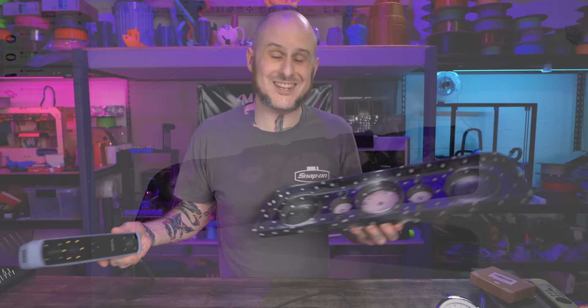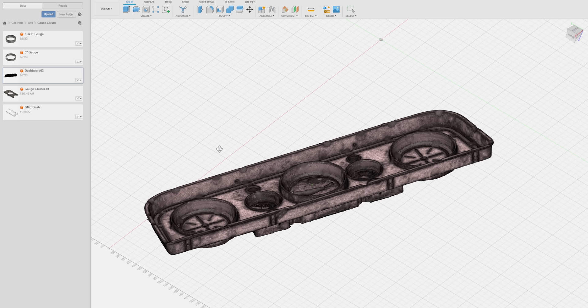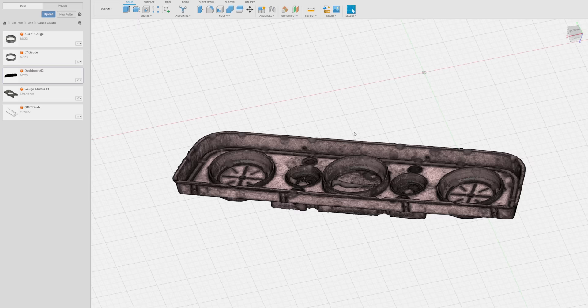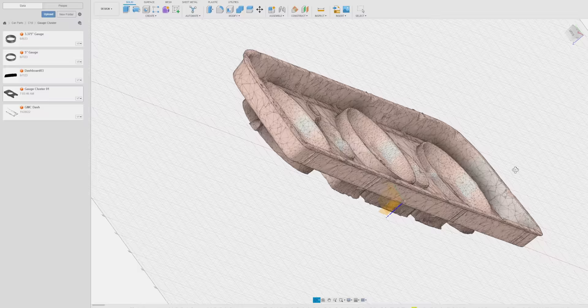I'm going to export an OBJ file that I can open up in Blender or what I'll use — Autodesk Fusion 360. Now this render has a lot of detail, a lot of polygons going on, and that is hard in Fusion — it doesn't handle that exceptionally well. So I'm going to have to reduce the amount of detail in there. That shouldn't matter since I'm not looking to one-to-one reproduce this component — I'm looking to just use dimensions off of it to design my part.